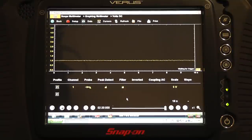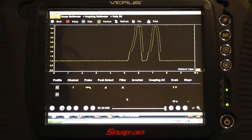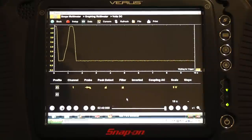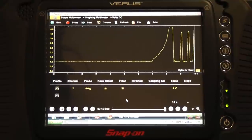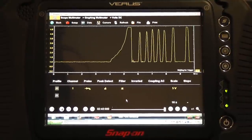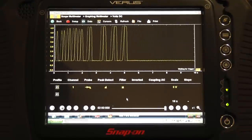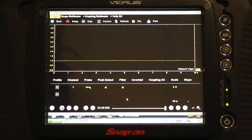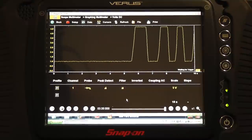You can play around with these numbers. Here's your sweep — no need to do it slowly like we needed to do with the scan tool or the digital multimeter. You can do this as fast as you want. Looking for a glitch or a dropout, you can do it slow or fast — I'm going to see every bit of a glitch or dropout in that signal. This is the preferred method for doing TPS glitch capture testing.